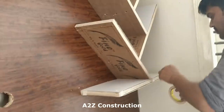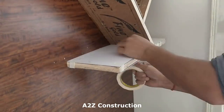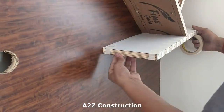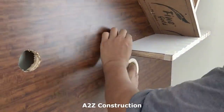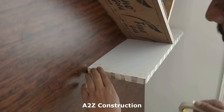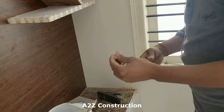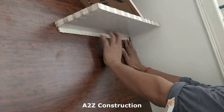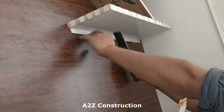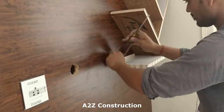This is one of the most important steps — during the entire construction they would have used at least 500 tapes. These are called abro tapes. The technique they use is to make sure at each corner there is no gap — they just put the tape there and make sure no gap is left, doing this at each and every corner.